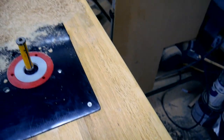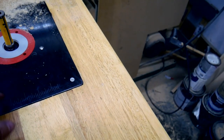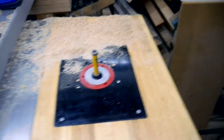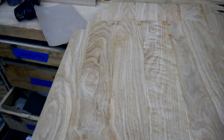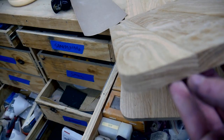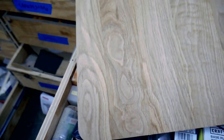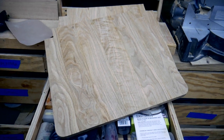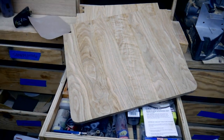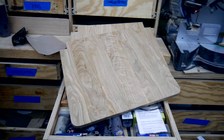I would love to use the top bearing, but my router doesn't go down deep enough, so I have to use the bottom bearing. That leaves a whole bunch of exposed space and it's just dangerous, so you've got to be super careful. Here's the finished product — it's just nice and repeatable, everything is an exact copy of the pattern, and the rounded edges come out really nice. I think it's going to get a chamfer around the perimeter. I'm going to use clips to attach it to the seat rather than permanently, which will give the wood room to expand and contract with the humidity swings here in the St. Louis area.